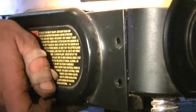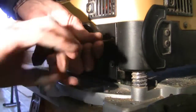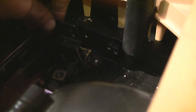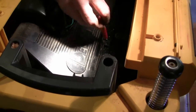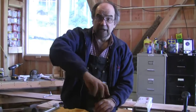Put the cover plate back on now. Back goes the handle. No cutter head lock is required for the Shelix cutter head. The dust extractor head goes on with the red tie-downs. It looks like we're done.